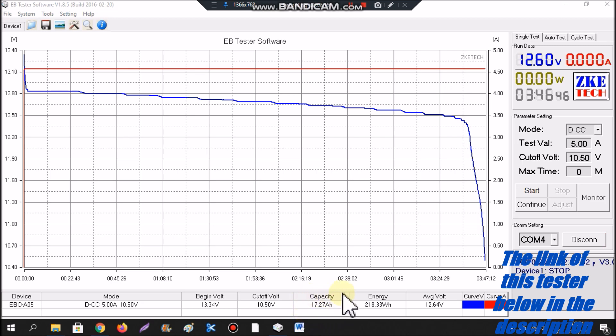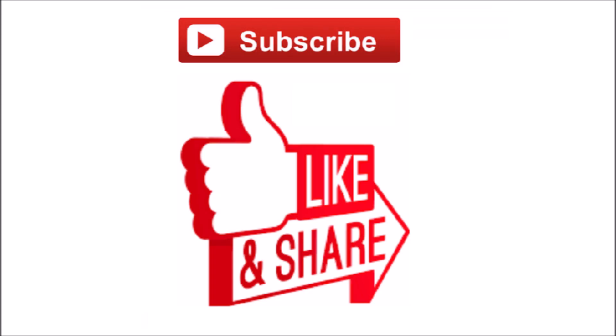As you can see, the real capacity is only 17.2 amp-hours — this is why my battery was draining so fast. The red line shows the current, which is a constant 4.4 amps, and the blue curve shows the battery voltage decreasing slowly during the test.